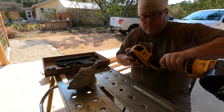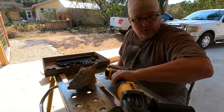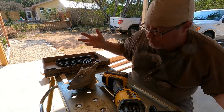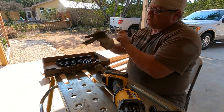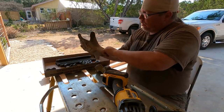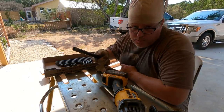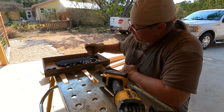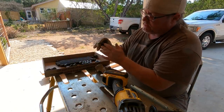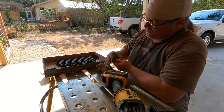Now I'm going to start with the metal work for the simple reason the paint on it can be drying while I'm doing the woodworking, and this could be a one day project. What I need to do is basically scour off all the black and schmutz and whatever oils on anything I'm going to be welding or painting, which means pretty much all the bars and just the faces of these little end caps and the faces of the nuts.